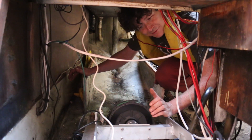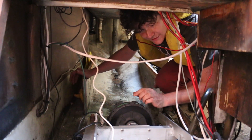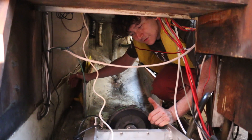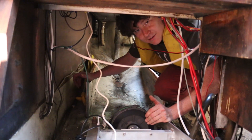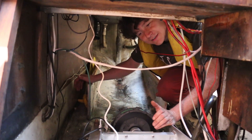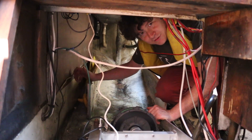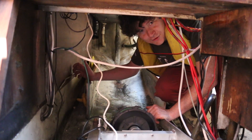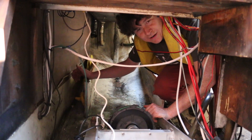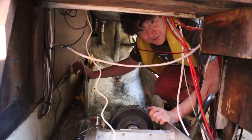For us this is a pretty fun and exciting project because we didn't have to do anything custom outside of our existing e-bike hardware other than getting this wound for a higher RPM. Our GRIN motors normally come in 5, 6, and 8 turn windings — the 5-turn being the fastest at about 12 RPM per volt. On this one we had a stator made with just 3 turns, and the 3-turn winding gives us closer to 20 RPM per volt. At 20 RPM per volt with a 72-volt battery, that should give us about 1400 RPM top speed capability to match the hull speed the sailboat needs. We suspect we'll mostly be using it at somewhat lower speeds, since power consumption increases quite a bit as you approach hull speed, and we'd trade off half a knot or one knot of speed if that means doubling our range.